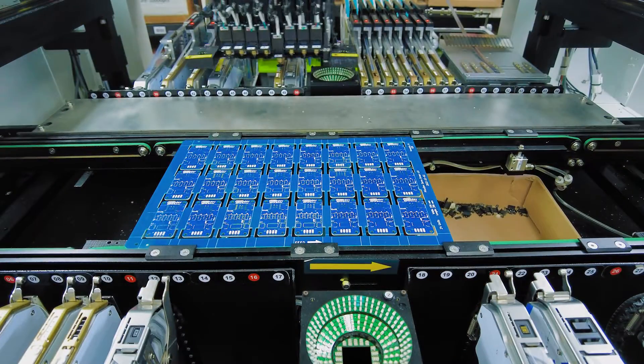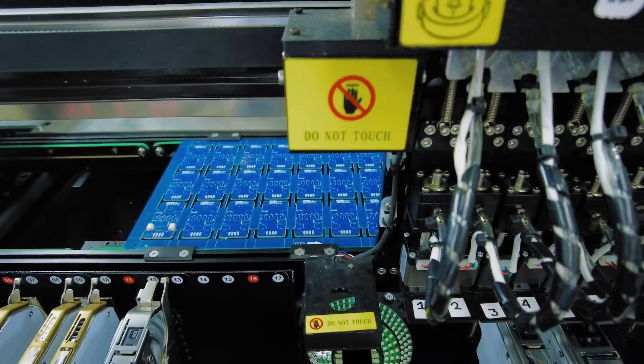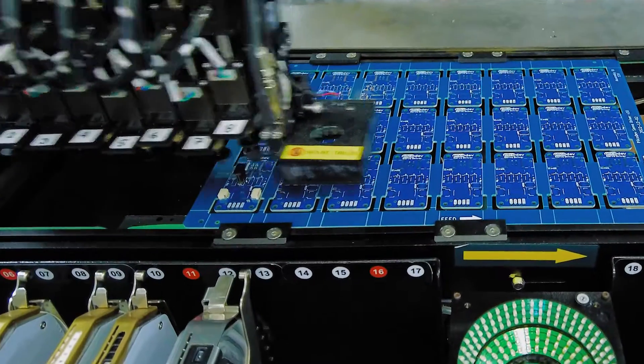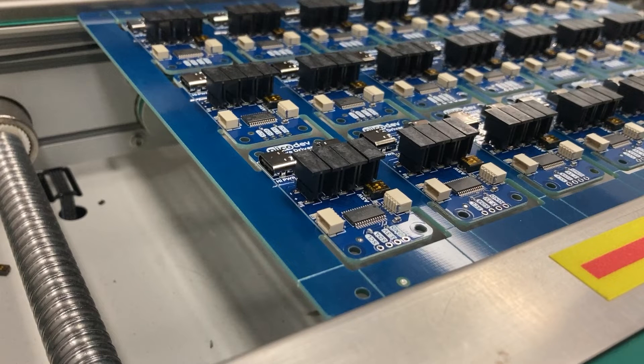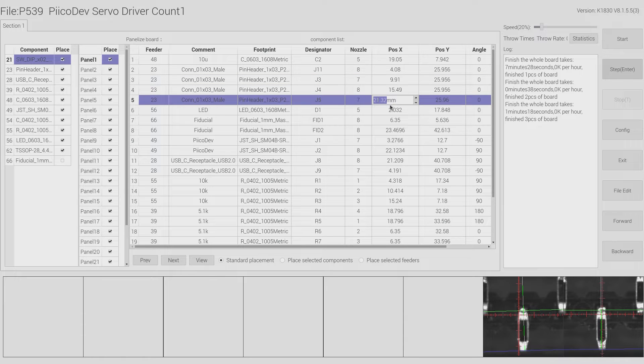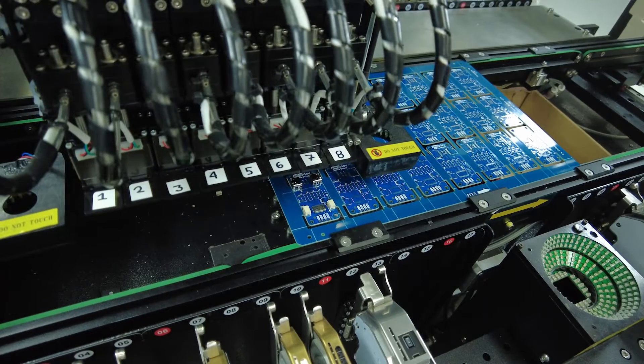For example, from a previous episode somebody noted the courtyards overlap by quite a bit - and I thought that's not a big deal, you just get some warnings from the design rule checker, and I could see they were going to place just fine. What a dummy - this is the value of the dry placement. In this case the parts are actually close enough that the caps bow during placement so the pins overlap, but these caps are used for assembly only and easy to forget about. The overlap was so minor that I was able to tweak the header placements by a fraction of a millimeter so the caps now clear and the header still remains totally on pad. We got lucky here, and lesson learned.